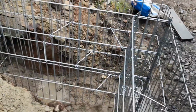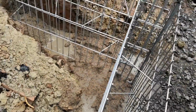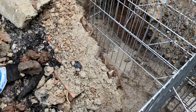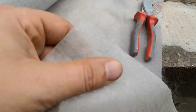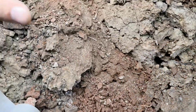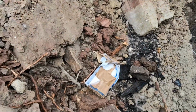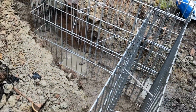Bring it below the line of sight, which means probably here. Let's take a look and then I will fill this area. Gradually, over time, the fabric has the capability of holding back dirt and soil. But water and moisture can easily penetrate here, so if it rains heavily now, this area will get soaked. I have flooded my drainage pipes behind my wall, and the water that collects here in front can then be filtered through this fleece.